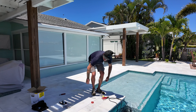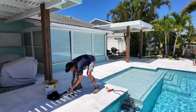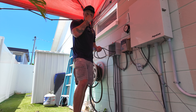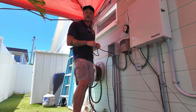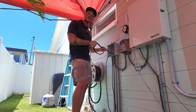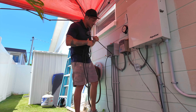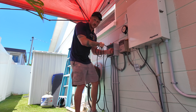Ian, are you expecting me to work today? It might help a little. Alright, I guess I'll help. Do you want to tug or should I? You can tug. We'll go ahead and get the process started. I'm over here at the junction box now. We've got the light fixture connected to the old light wire, so at this point we're going to be pulling over here until we have the rest of that light wire completely tugged to this side. As you can see it's going very easily — thankfully whoever did this conduit used a nice large size, so we have a smooth pull directly from the pool.